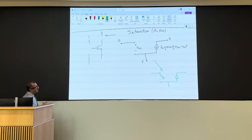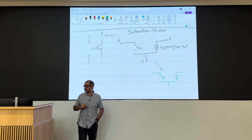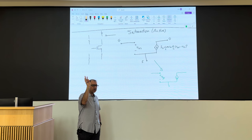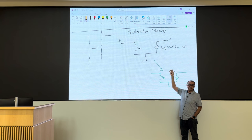Good question. If you look at high frequencies, the small signal model for a MOSFET has the capacitor here and the capacitor here. Good news for you, we are looking at low frequencies. Discrete MOSFETs suck at high frequencies, so you don't need a discrete MOSFET at high frequencies, you're way better off in BJTs or JFETs. It's a different type of integrated MOSFETs, if you want to use them at high frequencies, then those guys are included, but the values are small.